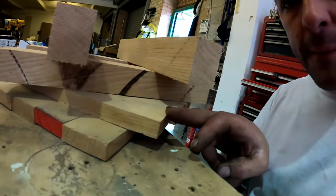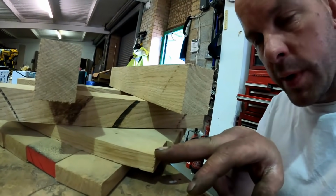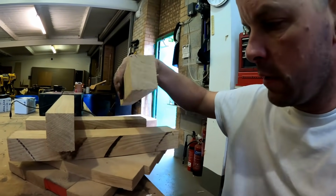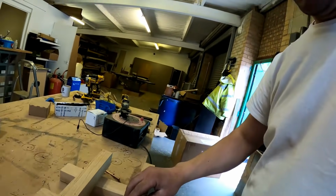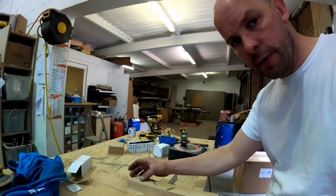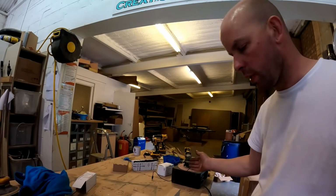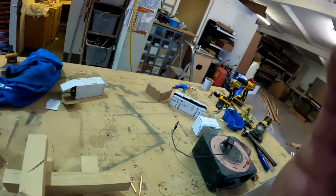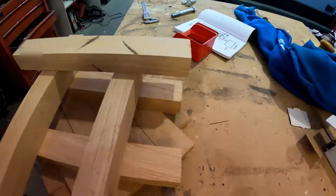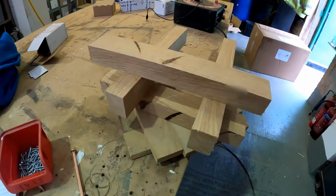As you can see here, this is our double diagonal planks. I've only screwed these together because I didn't want to waste the roves. There's our frames coming down, then we've got our stringers, and then the web frame goes over the outside of that. This is what the knees are attached to, and the deck beams are attached to this one, but these are only every three, I think. So I'm going to attempt to assemble this. Looking at this construction now, you can tell why it's a strong boat.